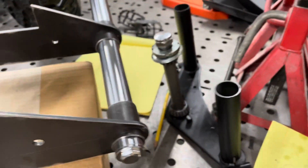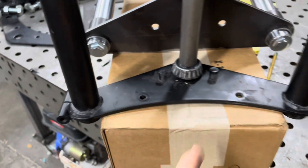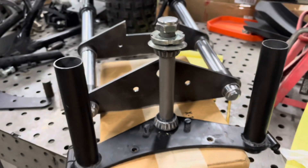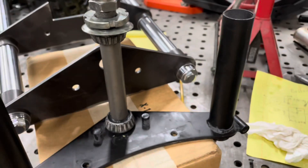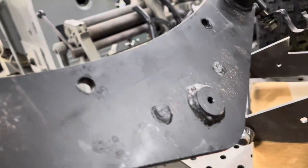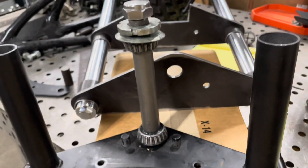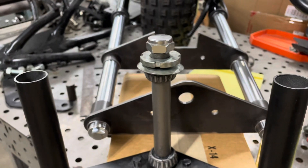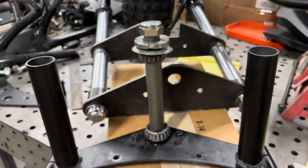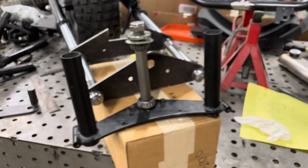Notice I got this notch here. I'm going to take this piece and cut this off right there, and I'm going to reuse this center section. I'll set her down in here, and that notch clears all this stuff, and the weld's on the back. Then I'll weld that piece to this piece, and I'll have all this already done and don't have to fabricate something from scratch. Kind of keep it easy for myself — I've got enough welding to do as it is.